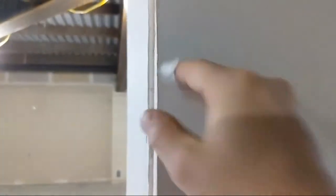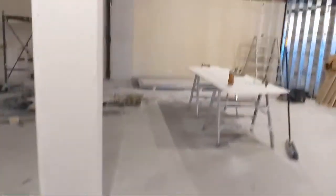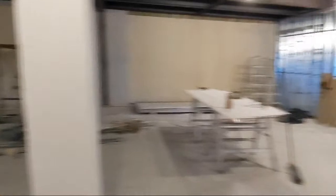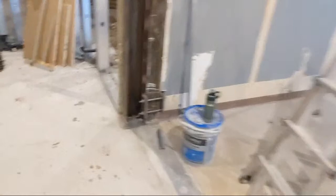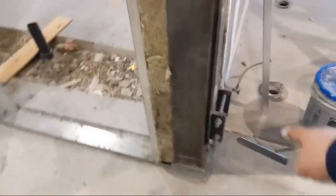When I put these babies on, I'm also lasering this side and this side even, to make sure it's not going to come in and out while I'm screwing it off. Once this piece is in, you screw angle on here — you screw angle all the way around for the corners. And when you're putting these ones on, you're going to laser up this corner, coming this way. Not the actual drywall piece itself — you want this to be straight. So it's pretty cool — a couple of different column layouts here.